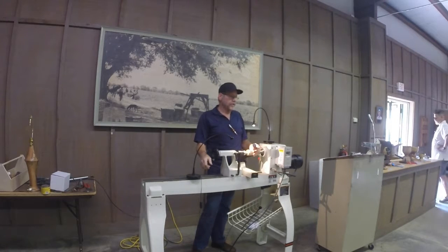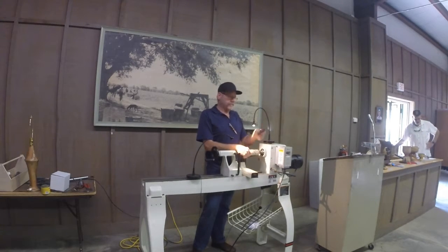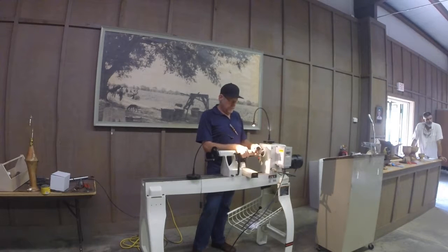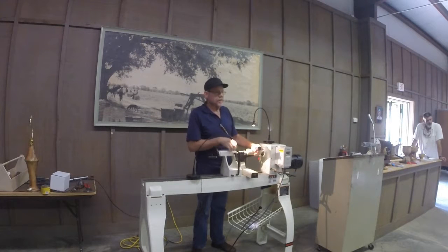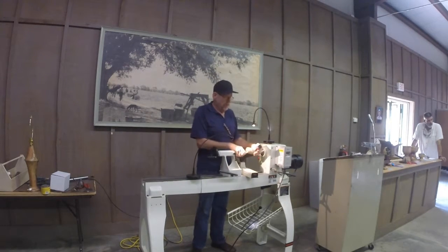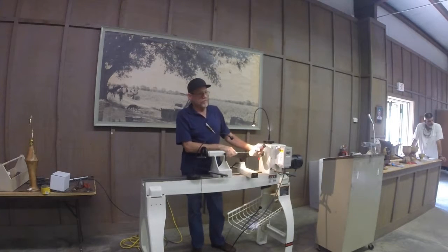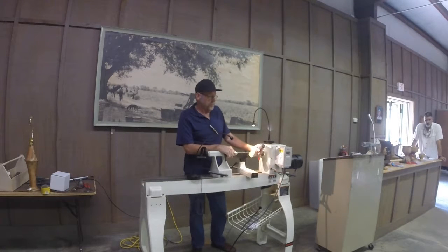The thing I typically go with is something that dries fast. Because otherwise, like I said, I'm building a big dam around it with tape and trying to do all kinds of stuff. If you don't put acrylic in it, I would think you probably have to seal it with the tape to keep it from sticking out of it. Like I said, I used the casting acrylic, which is casting resin, which is an acrylic. And I thought I had it set up with one of those lamps similar to that. And the next morning, I had a puddle on the floor. The stuff typically takes up to 24 hours to dry, which is normally not a problem.